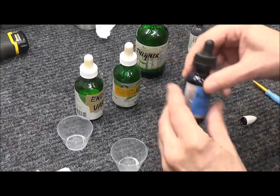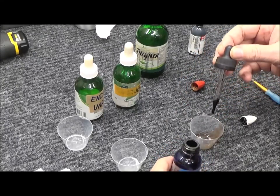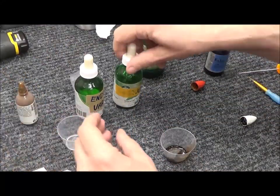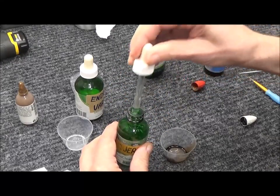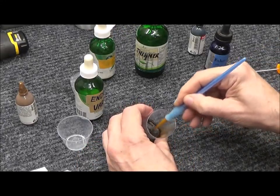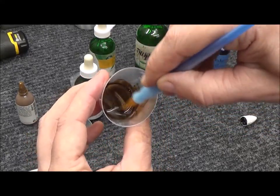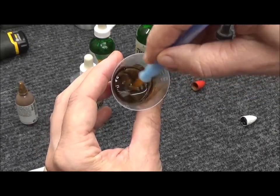And then for the Kalamazoo brown, this is the dye or stain. I give it a full drop. See how that mixes in nice. The pigments don't like to mix in as well. There's a little full viscosity lacquer. And then I'm gonna try to get everything to blend together right here. It's a nice dark medium, maybe medium to dark brown.